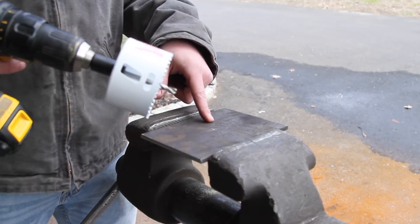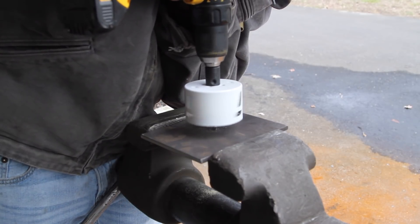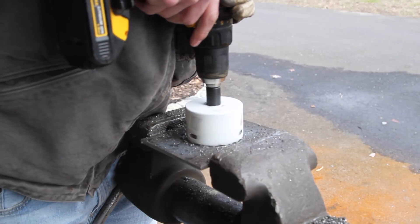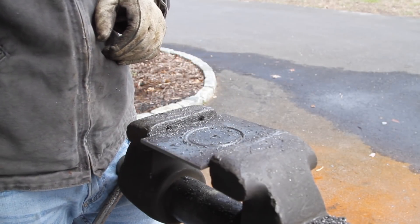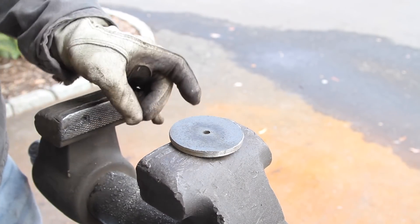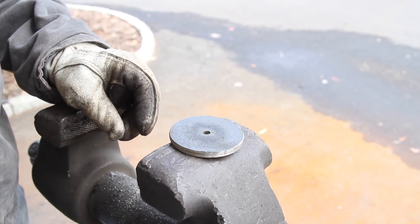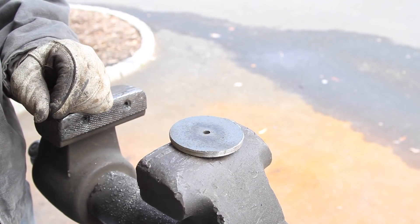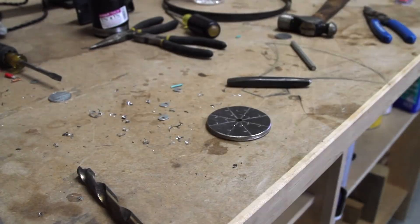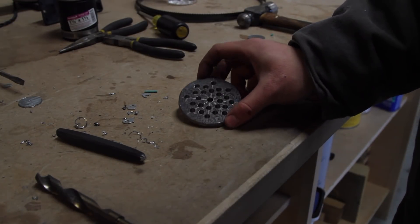Now I need to drill a hole in this quarter inch plate with this three inch hole saw — I'll explain what this is for in just a little bit. This round piece of plate is going to function as the ribbon burner. It's going to get welded directly onto the end of the pipe. Unlike Venturi burners, forced air burners work much better with ribbon burners, which instead of having one big hole, have multiple smaller holes that the flames come out of. I just finished drilling all the holes — they're a quarter inch diameter — and the next step is just to weld this to the end of the pipe.